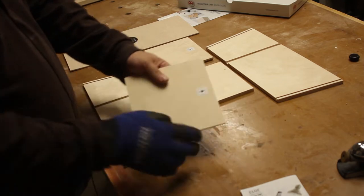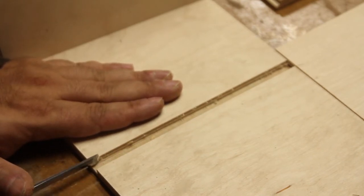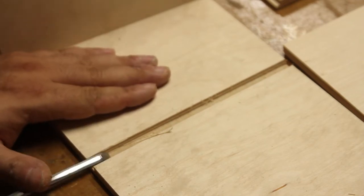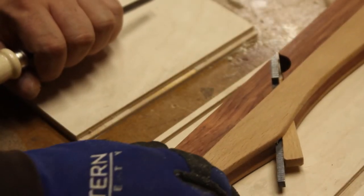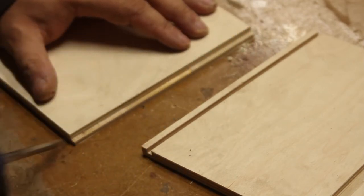I'm going to go ahead and dry fit this together. They put up arrows because there's bevels here. There's a little fuzz here — it's not too hard to clean up, but if you were building this and didn't really have a wood shop, a screwdriver or something could knock the fuzz out. That one's a little loose where these are a little tight. I tried using my little shoulder plane but it was just taking a little too much of a bite — I just want to take a tiny bit off. Get the fuzzies out.